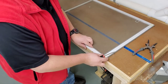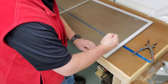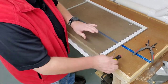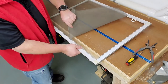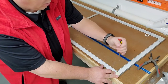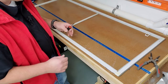Once the spline material is removed, go to the corner of your screen and slide your screwdriver up and down a little bit in each direction. If these screens have been in there for a while they're going to be almost molded to the existing aluminum frame. Once you do that, if you push from the bottom side it'll start to remove easily, and from there just keep pulling until your screen is removed. Now that your screen is removed, the track where the spline material lies will need to be nice and clean — you might have residual screen material in there. Make sure you run your screwdriver and clean this out all the way around so you have a nice surface to install the new material into.